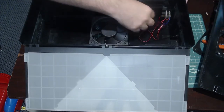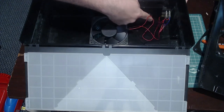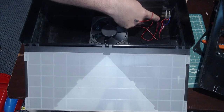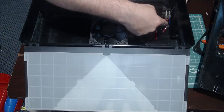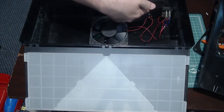I took the red wire and I soldered it to the new switch. This wire that comes out of the switch, I just used a T-tap to go into the hard line coming directly off the plug. The black wire, I just went directly to the blue wire because that's the negative. And it was that simple. Drilled a hole, put the switch in.